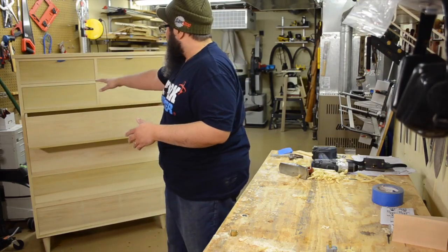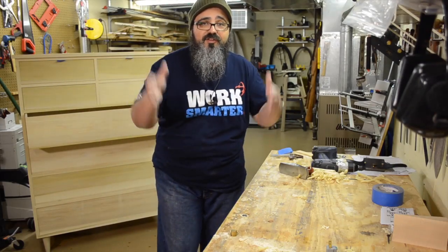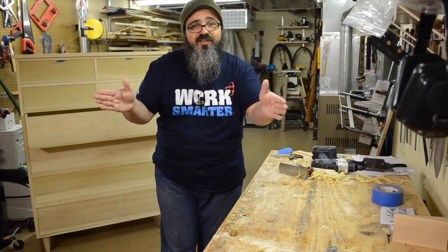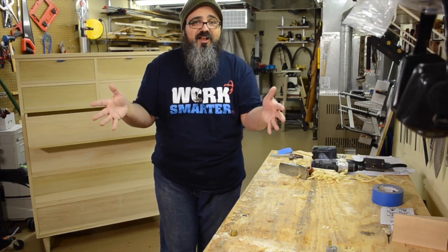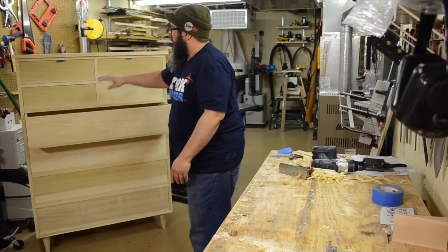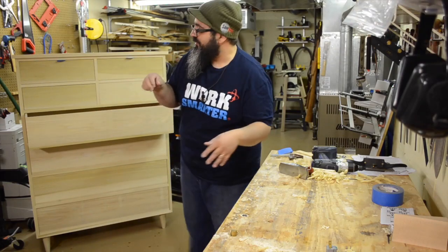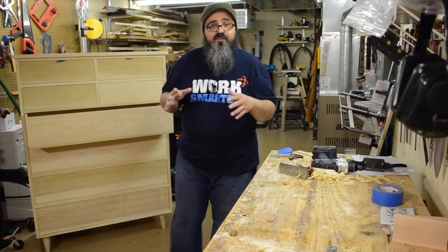So that's how easy it is. I did it with just the one. I'm not worried about the sides here. If you needed to give the reveal a little more on the sides, just that slight chamfering — just like what we did on the bottom — will give you that shadow line. With just a small tweaking on this one to catch what caught my eye, essentially we're going to continue doing that chamfer, and I have that left to do on all the rest of these.